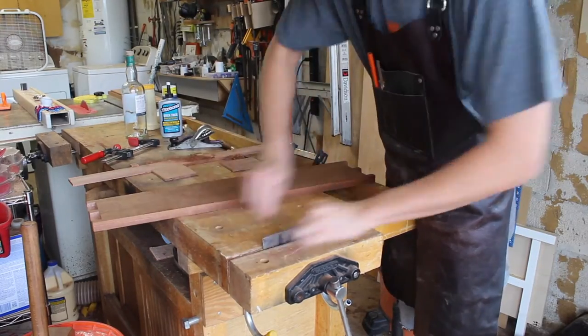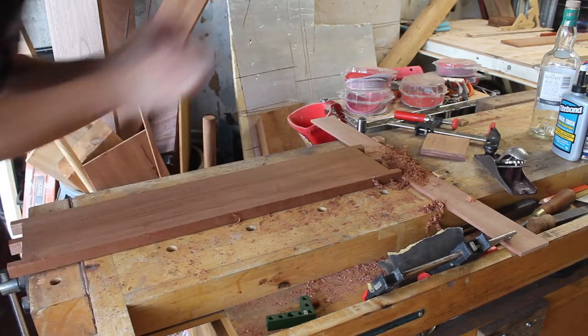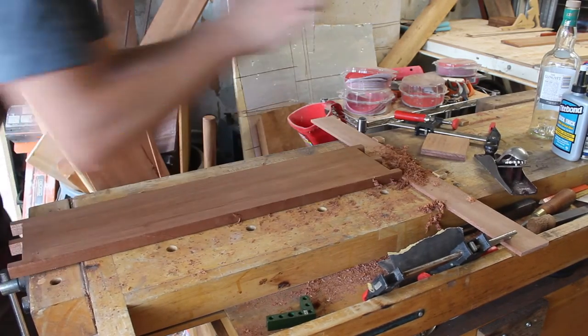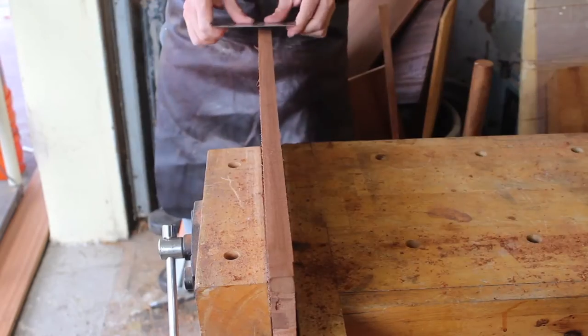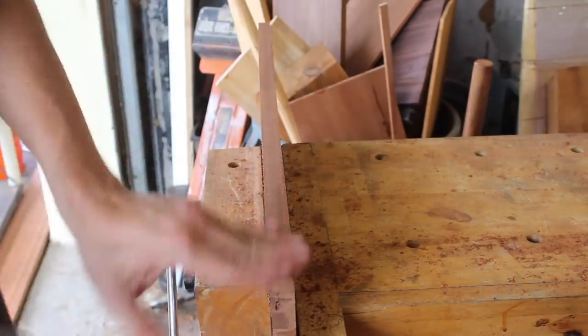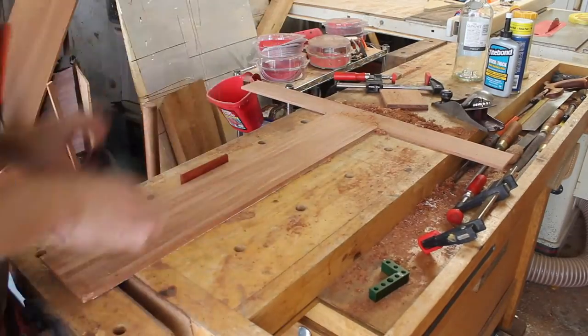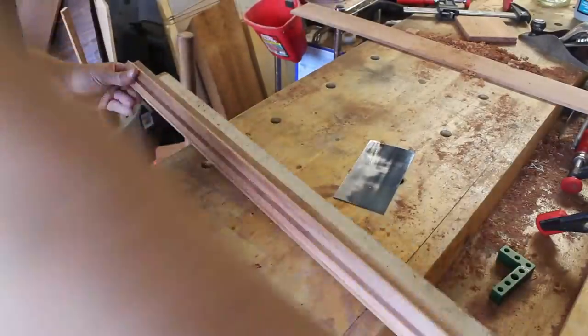Here I'm going to town burnishing up the card scraper in real-time speed. I'm a really big fan of card scrapers — I love getting that nice sheared surface. Sheared surfaces tend to be a lot finer than most sanded finishes. I'm also then going to use some 600-grit sandpaper as a final pass and get it all in between the grooves of the tambour.